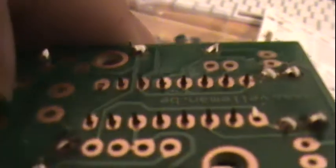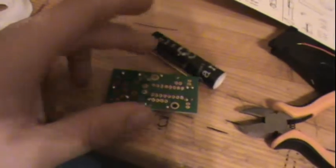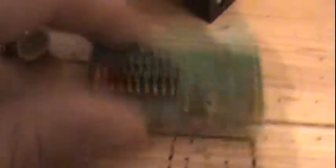Next, for the IC socket — I'm gonna put it in. I'll come back to you guys in a moment. Put the IC socket in, but not soldered yet. As usual, I bent two of the pins to keep it in place, so I'm gonna go ahead and solder it right now. Alright, I got the socket installed. All in.